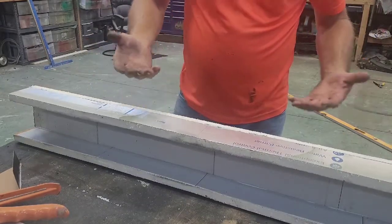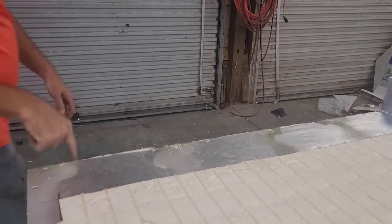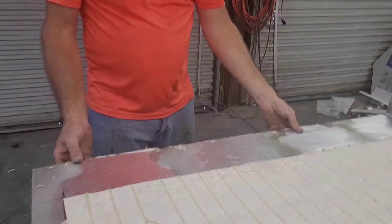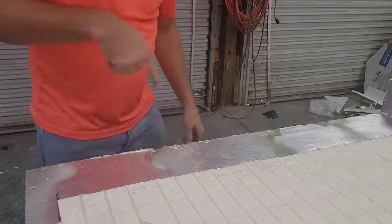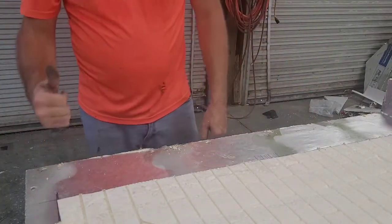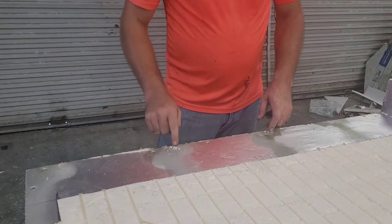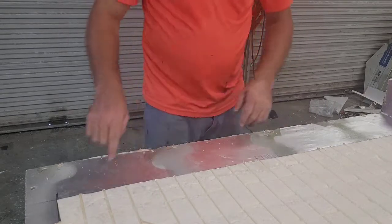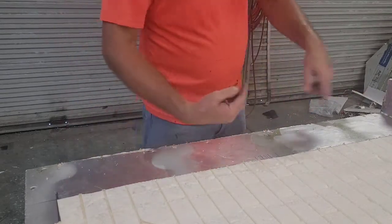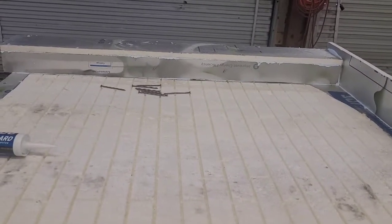It's unlikely. And all I do on this part, now because I put the piece of wood on the bottom here, I took a drill and I drilled 4 holes there so I can shove the nails through. Now, unfortunately, my nails are not going to be at an angle on this part. I'm just going to have to deal with the fact that the caulking is going to have to do the bulk of the work. But when I run the nails on this part, they'll go at an angle. And I said, I've got to do this bottom side.